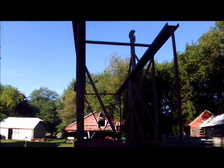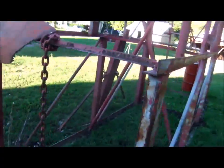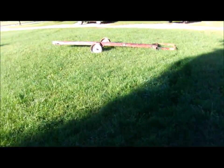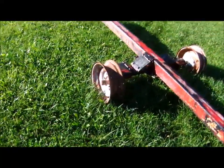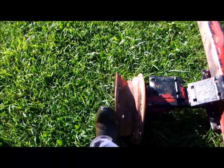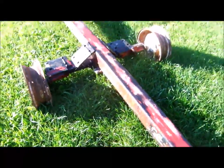This trebuchet has some other features. In the front there's that plow moldboard where the winch system pulls the cable and it slides on that. This chain is for the release mechanism — it clips in up there and releases which fires the trebuchet. Here's the throwing arm that fits up there. These are the steel rims that roll across in the track. There's about a half inch gap — the channels are about six and a half inches wide and this is a six inch wide rim, so there's a little bit of slop for it to roll.